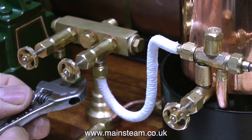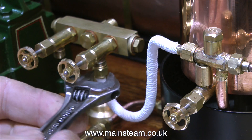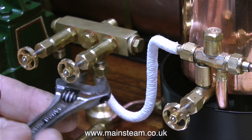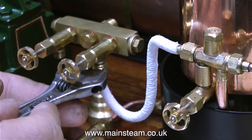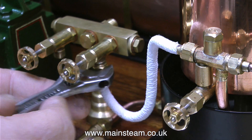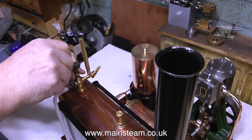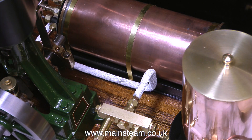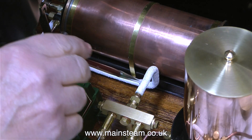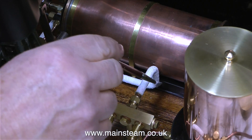Underneath the 504 boiler are a selection of tubes. Most of these are water tubes that carry water from the boiler, giving a greater surface area to heat the water. But the centre pipe is a superheater. The steam comes out of the boiler, passes back through the fire, and then back up to the main steam tap on top. So the steam from this tap is very hot indeed — you would burn yourself badly touching a pipe connected to this supply. That's where the pipe lagging comes in; there is some thermal efficiency involved, but it's very little. It's really just to stop you burning your fingers.